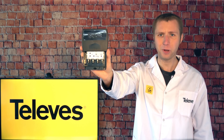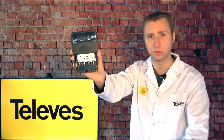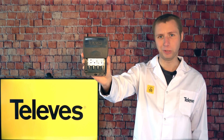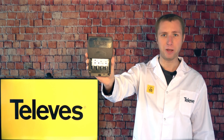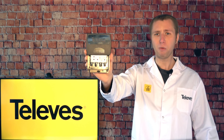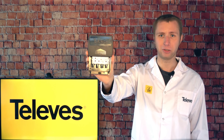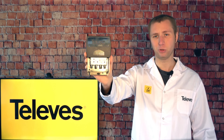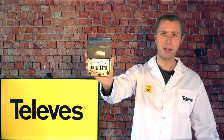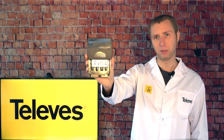This is also the only preamp I know of on the market that has the option to connect two antennas without separating the frequencies. Other preamps with separate VHF and UHF inputs would not work to combine antennas from different markets, because each antenna has VHF and UHF channels it's trying to pick up — you'd only get VHF channels from one market and UHF channels from the other. This preamp would solve that problem.